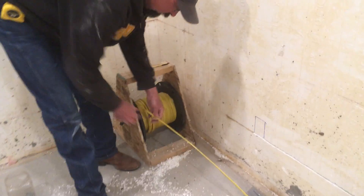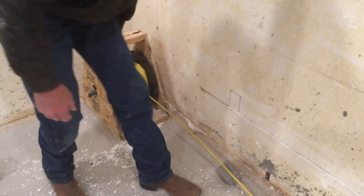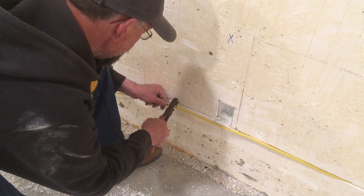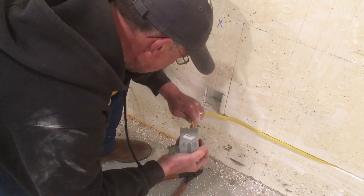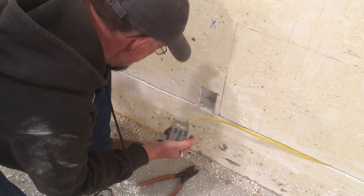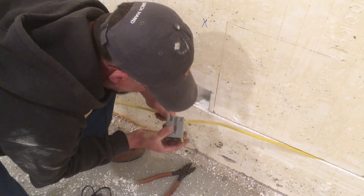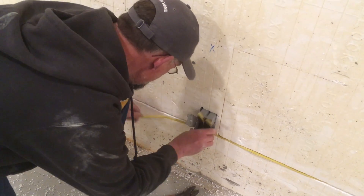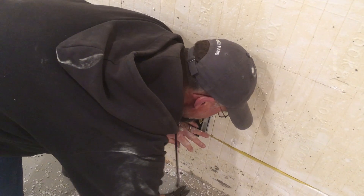As far as the wire goes, you'll do yourself a giant favor if you set up some kind of a reel so that the wire comes off flat and straight. If you're pulling it out of the side of the coil with all them kinks in it, it'll take you a lot more time to get it straightened out and pushed into the kerf. So I come over about 8 inches or so past my box, cut that — and this is where we've got power coming into this box and going to an outlet, and likewise power going out of the box to the next outlet. You can always trim off a little extra, a whole lot easier than wishing you had just a little more.